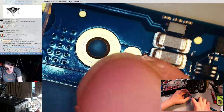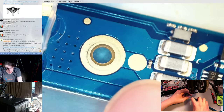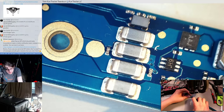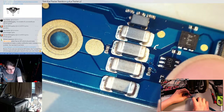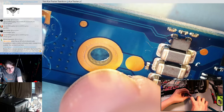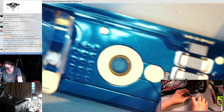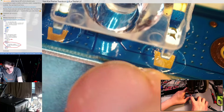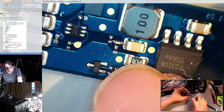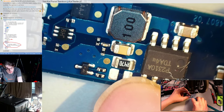Yeah, so this is going to be ground, I think, because you actually have that coming up through the via. Well, not through, actually, just around the screw hole. So where does it actually come up? I don't see the vias. They might be doing via in pad on this board again. So it could be there are vias that we can't really see easily, like that little indentation. This might just be via stitched all around and then they filled the vias. So that might be what's going on for ground. And then presumably... Okay, so this one is going right into the LED. This might... Oh, this is the resistor for that LED? Huh. Maybe that resistor is unrelated.